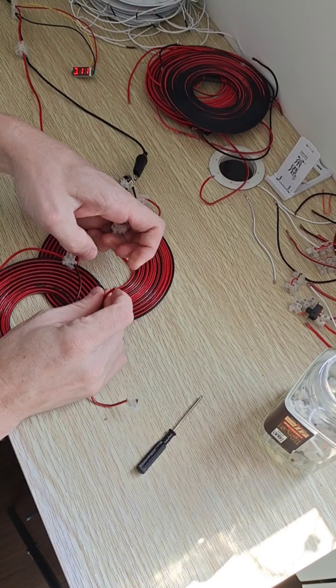I'm just going to grab an LED — and this is the hey presto moment. It doesn't matter which way you put the LED in because it's pulsed DC. Do we have light? Yep, we have light coming out of the second coil. I realised that there's a TIP31 that's not great and I haven't got a heat sink on this one, so I don't want to run it for too long. But as you can see, the LED lights. LED lights if you put it underneath, LED lights if you flip it over — any orientation that you put this near. Even sometimes the LED lights when it's not even fully on, but obviously it's brighter if you put it fully on.